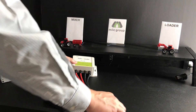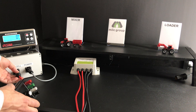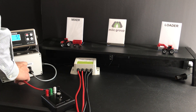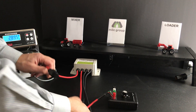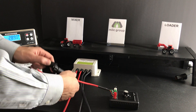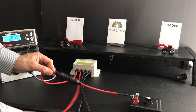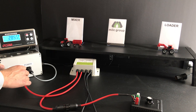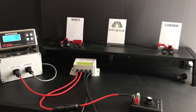The way you wire this up is you literally take the load cell cable right here, which is simulated through this dial, you unplug it, then you plug in the load cell in cable right here — literally plug and play. It routes it through our box and puts it right back into the scale head so you can still get weight recording here as well.